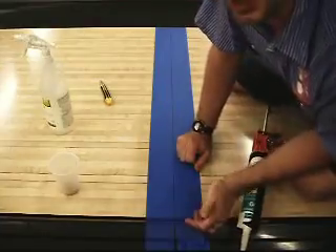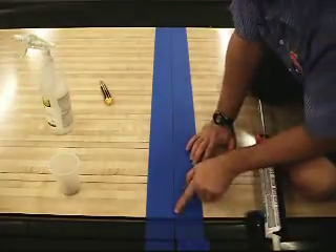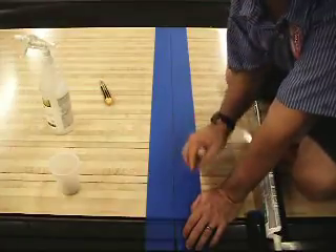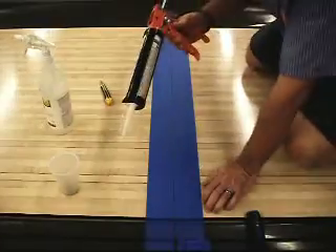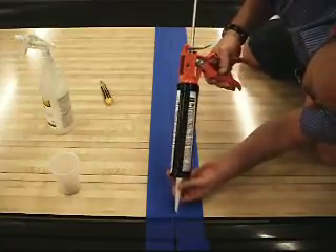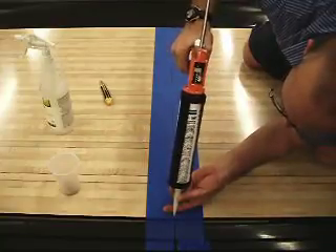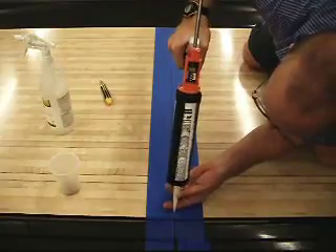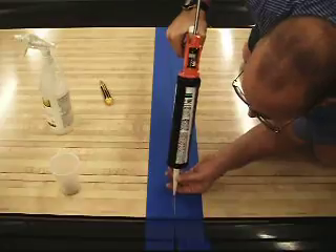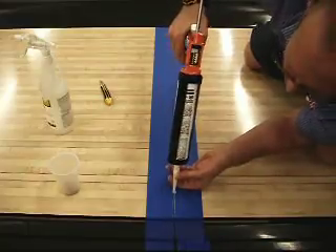The reason you leave your sides open is that when you're pressing this in — because later we need to take a knife and press it into the seam — you want the air to escape from both sides. If you cap your sides and start pressing it down, you're going to get bubbles through the middle and it's just a pain. As it comes out the other side it should look kind of like a molehill — when a mole is digging a trench and the mound comes up out the other side, that's what you're looking for.